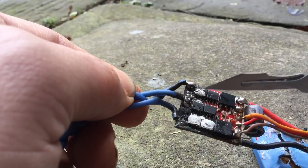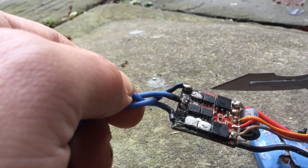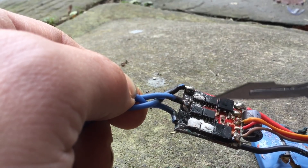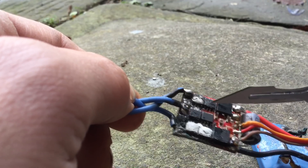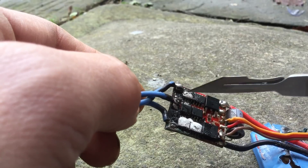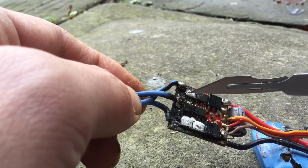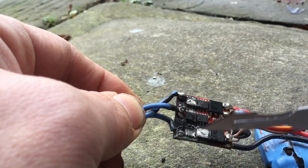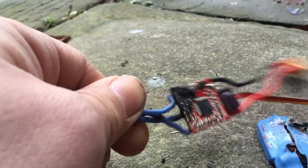That's just crazy. So if we take a guess, these FETs were maybe 5 amp — maybe they're normally about 10 amps per block. So this was supposed to have been a 20 amp ESC, quoted for 20 amp, because they're normally 10 amps, so you put two FETs per channel per wire coming out. And it's absolutely cut. Don't think we'll be fixing that one.